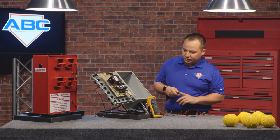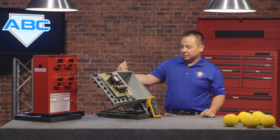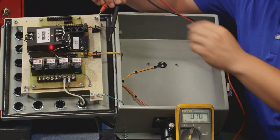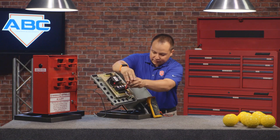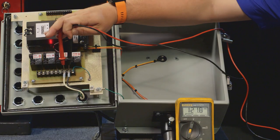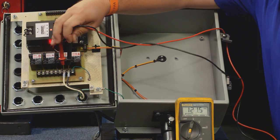Once you're on AC voltage, you can check things like: am I getting power to the light box? We have a PT8 light box here as our example. I can go over here where I know the power is coming in and see that we're getting 121 volts, which should be about 115 plus or minus 5. So we're good there.